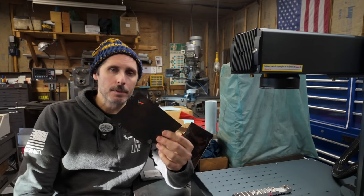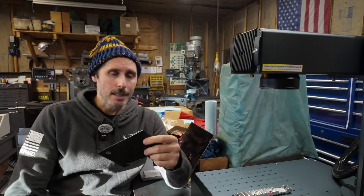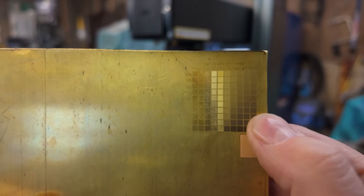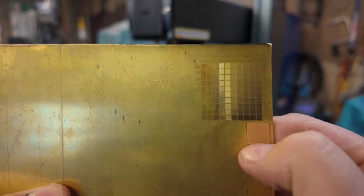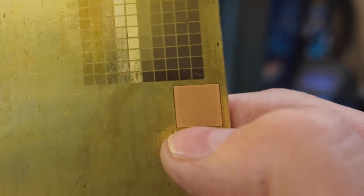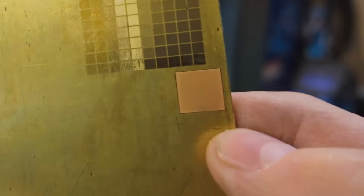So we've proved that a fiber laser can absolutely cut metal — it's actually pretty good at it. Here I have a 16-gauge piece of brass. You can see that I've already run a quick little test grid on it, as well as a test engraving of a square. This square is indeed engraved below the surface, and if you can see it, just take a look at the texture and color of the background of that square — that is just a nice looking effect.